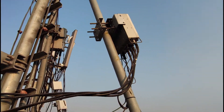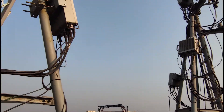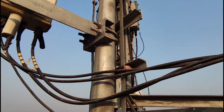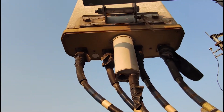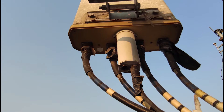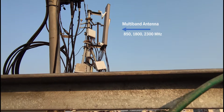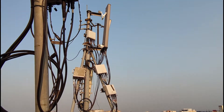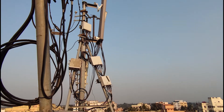Let's go close to the bottom of the antenna and look at what ports we see here. I found that most of the antennas have four antenna ports, also called ANT ports. Some have just two ANT ports, and then there is this multi-band antenna with eight ANT ports. Leaving aside the multi-band antenna, the rest can operate on one band, is what I think.